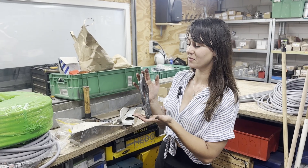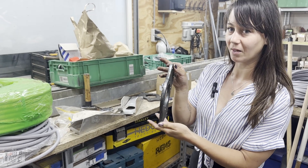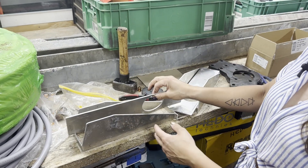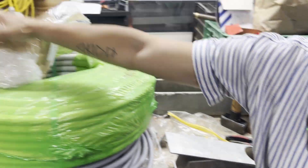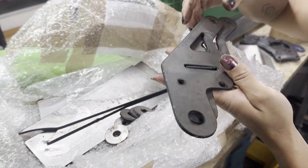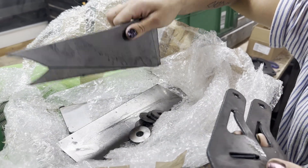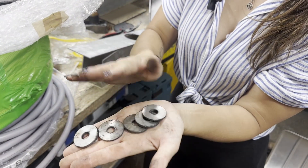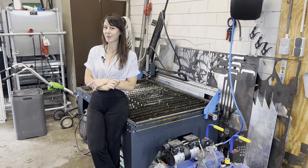We've finally made the parts for the Civic. This is made out of 10mm sheet metal — this is the brake caliper and wheel bearing bracket. Over here we have the end tanks in 3mm aluminum for the intercooler, and here we have some parts for the rear suspension: brackets for the intercooler mount, more rear suspension parts, and some rings. Now that we've seen the plasma cutting, the next part is putting it all together with welding and making something out of it.